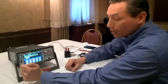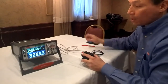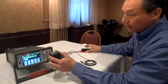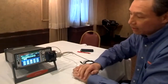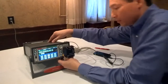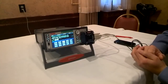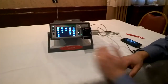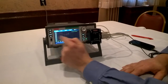Now you had mentioned something about a waveform capacity in this. Yeah, absolutely. So I'm going to demonstrate that right now. What I'm going to do is generate a signal source from my iPhone and run it into the DMM — just to show you what it can capture. This is simply a microphone. I can hook up into my phone here. So I'm going to switch into the front jacks. Now my signal source is coming in through here. This is a menu-based design — if you want to go to the menu screen, you can quickly push that and jump to the graph, or navigate to different measurement settings, screens, triggering, and system settings.